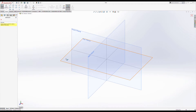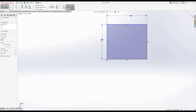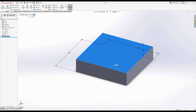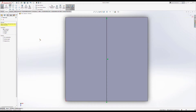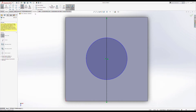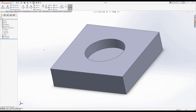The basic part we're going to make is just a little box with a circle cut out of the middle of it, as an example for how to do a simple cut on the Tormach. We're going to start with a sketch on the top plane, do a rectangle, and make it 4 inches by 4 inches. Then we're going to extrude it out to 1 inch tall, and then go back to this face and put in a circle right in the middle of the part. We'll make that circle 1 inch, extrude-cut it back in half an inch so it has a little bit of depth.